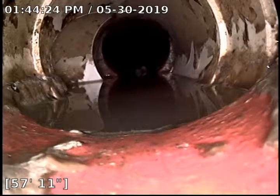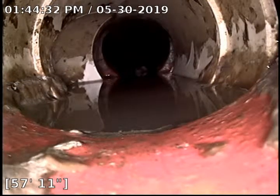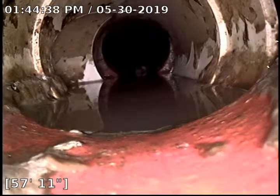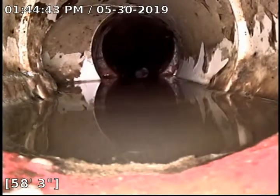I'm in the older part of this house that's original. I ran my camera down the roof — a three-inch copper line. I got out to about 58 feet and I come to this spot where we've got newer pipe, like a PVC. The problem is the way it's attached, it drops off into water.